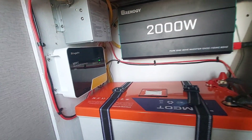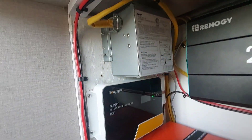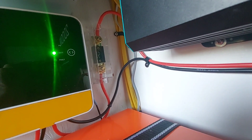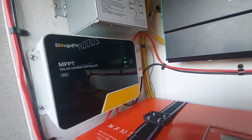We got the new solar controller put in. I did have to move some things — I had to move the transfer switch up and then move the fuse over. I had to add a 40-amp fuse; I had a 30-amp fuse in there before. So got this all wired up and now I'm going to put the solar panels on and see how that goes.